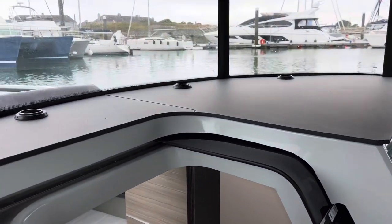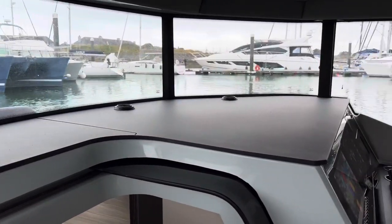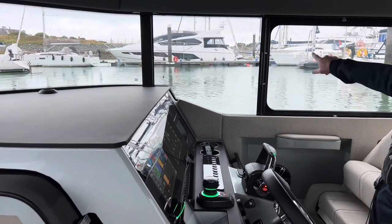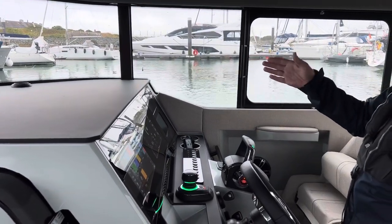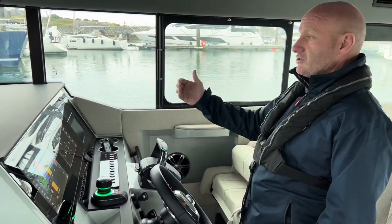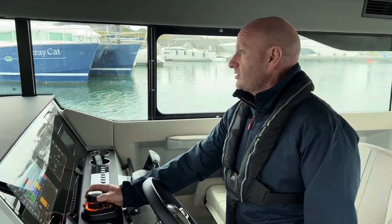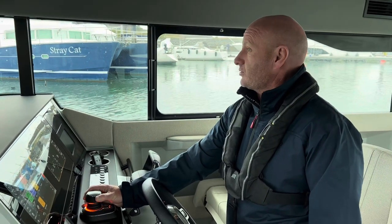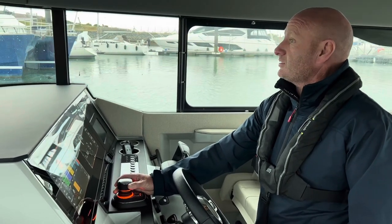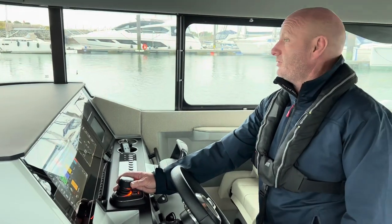Or if I turn the disc backwards on the top to the left, the bow goes in the opposite direction. Looking over there, we've got tide running or water running from left to right. As we go sideways or hold it sideways, we're holding the bow into position, but we could be getting pushed backwards or forwards at the same time. So while doing those two movements — going sideways and holding the boat square to the pontoon — I can also go backwards or forwards to counter the effect of the water pushing me.